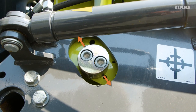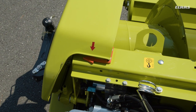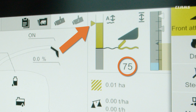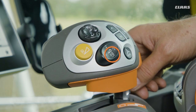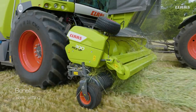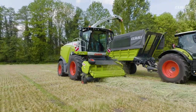On the right-hand side, it is quick and easy to show the driver the correct position using the driver's visual indicator. The operator saves this setting by pressing and holding the ground pressure control for active contour control button. This ensures optimum automatic ground tracking. Setting and learning processes are simple and fast, and are saved for repeated use.